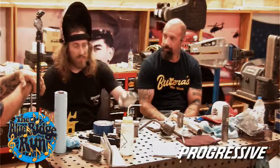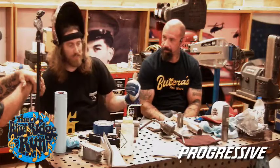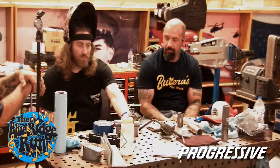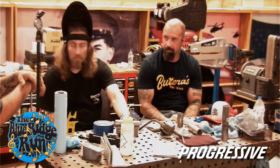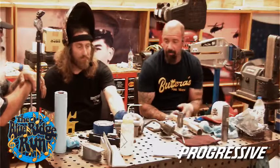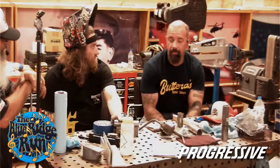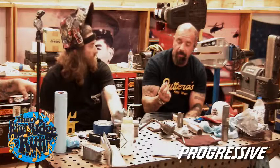What I was going to say too about fusion welding exhaust pipe, when you're purging it, as Brian mentioned, it helps cool the inside. It also holds it out, so fusion welding is a lot easier if you actually have it purged. And would you purge something like this, Brian? Yes, definitely. 16 gauge wall exhaust. I always purge it, and two, I always use at least some amount of rod, even if it's the really small rod.